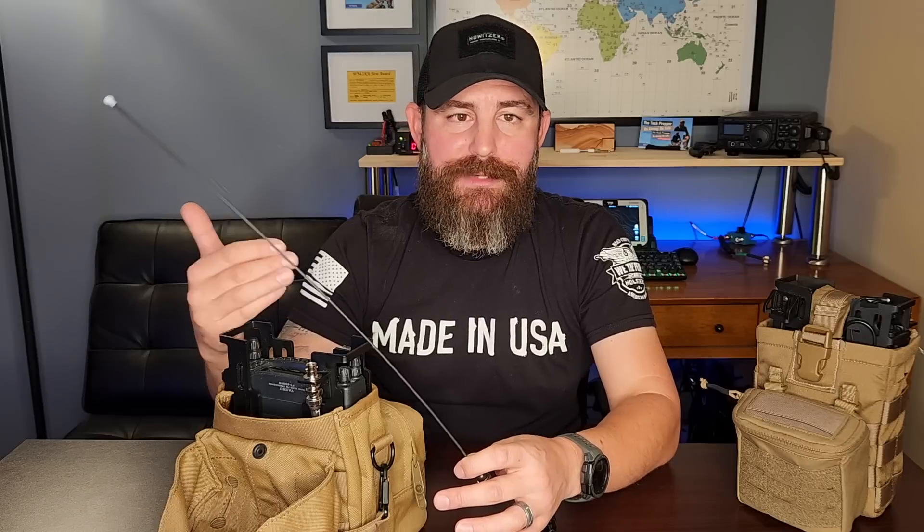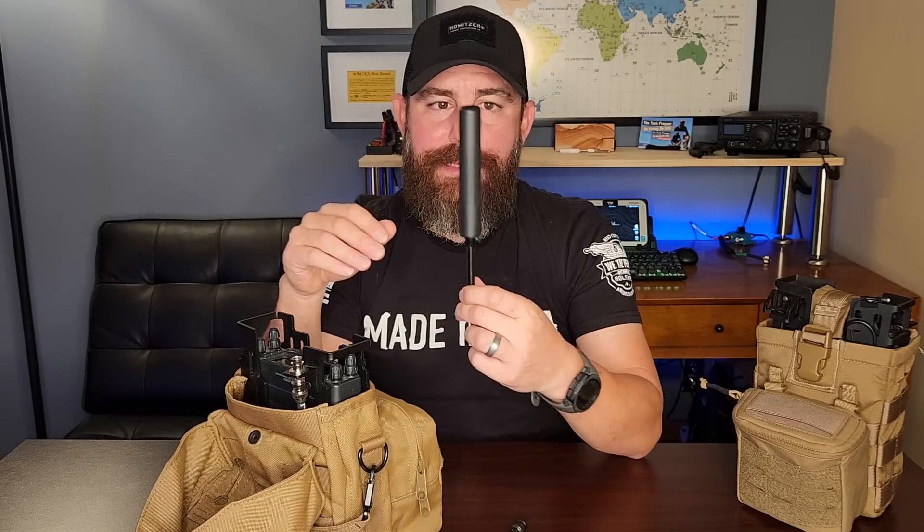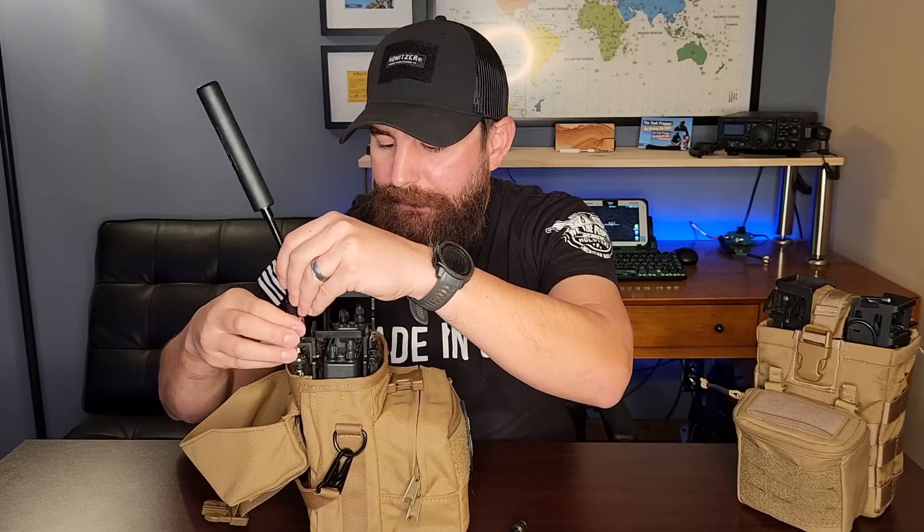The big issue you're going to have with antennas like this is that you're missing the other half of the antenna. You're likely going to have high SWR, and if you're pumping higher power, the more power you push into this system, you're likely to damage the finals or other components on your radio. So not good for you, not good for the radio. I know it looks cool to have a TCA antenna on there — it looks high speed — but bottom line, I don't recommend this setup.